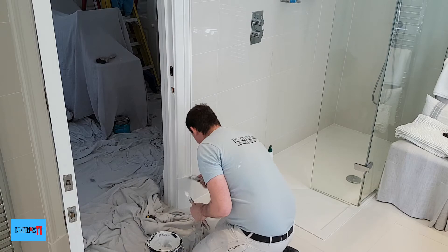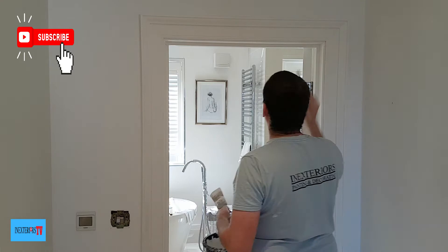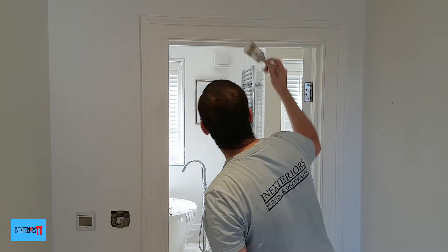Time to move on to the other side of the door set. Next I paint the top section of this frame — and this time I don't just paint the lip of the doorstop; I paint the whole underneath part of the doorstop as well.